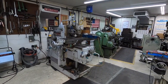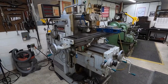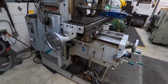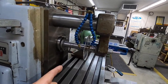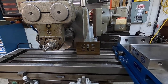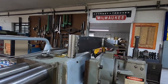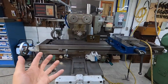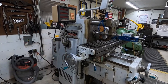Looking down here at the other end of the shop, we've got our Kearney and Trecker horizontal milling machine — this is a model 307 S12, hydraulic-powered. I acquired this probably five or six years ago, did some work on the knee and the motor, and got it running. It's a pretty good machine. I love having the horizontal capabilities — we just did a little job cutting some aluminum tubing off with an angle plate set up. Up here we've got a parking attachment that I fabbed up to hold the vertical head.